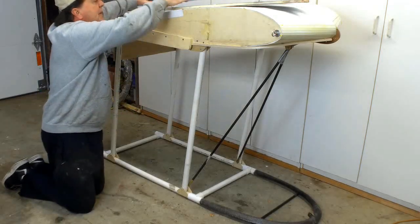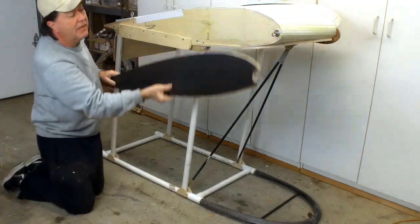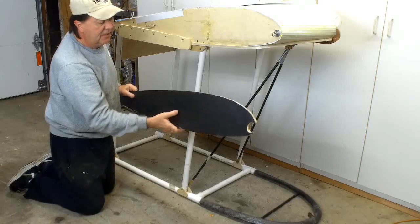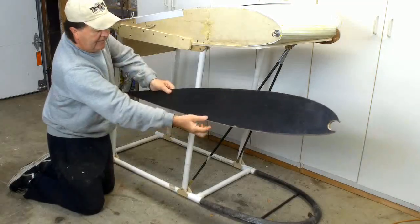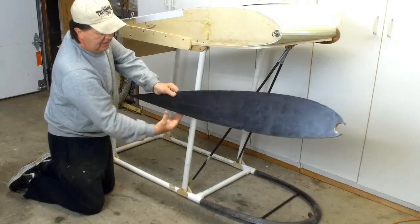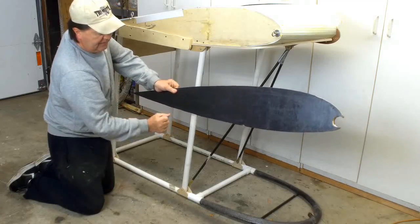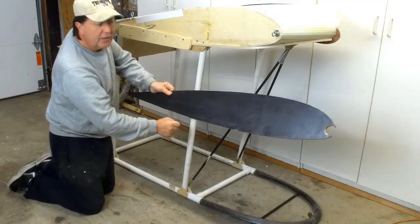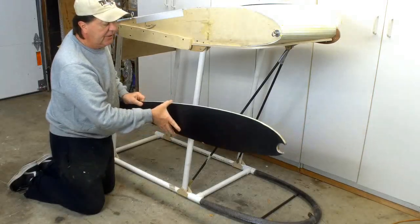For the pilot suspension, the rib is much stronger. I have this one here. This is flight hardware. It's carbon fiber on both sides. And this is going to have a relatively long bracket on the back here that sticks down. Going to be on both sides and come together like this for the pilot hook in. You can hook in at different locations depending upon your weight and how you like to set the CG.